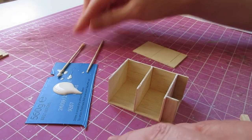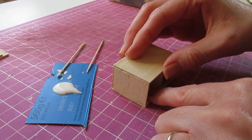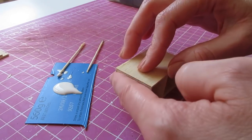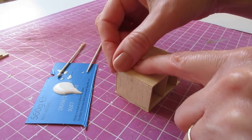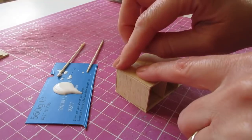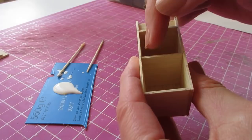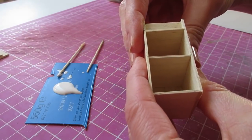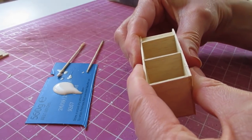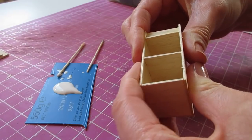Turn that onto its side and position the plinth — it should be sitting just behind that little pencil line. Apply glue to a long and short edge of the plinth and stick it into place, pressing your finger against the shelf for support. Give a good firm press, making sure it's sitting straight at the bottom so you've got an even amount from front to back, otherwise it will look a little bit uneven. Remove excess glue, then attach the side by applying glue to all the outer edges. You would make a top, bevel the front and sides, then attach it so the flat edge is flush with the back of the unit. Attach the side getting that top bit lined up first for a nice flush edge.